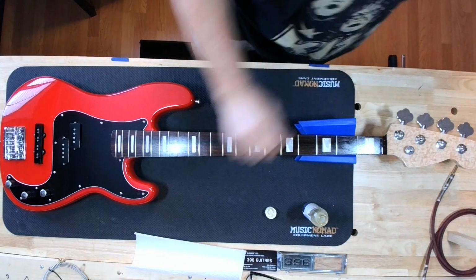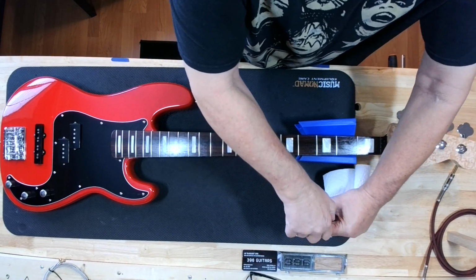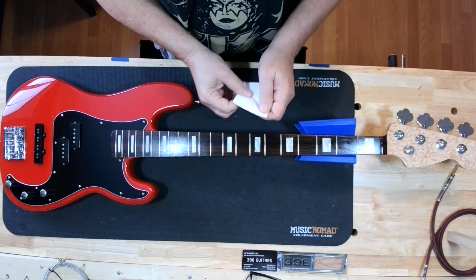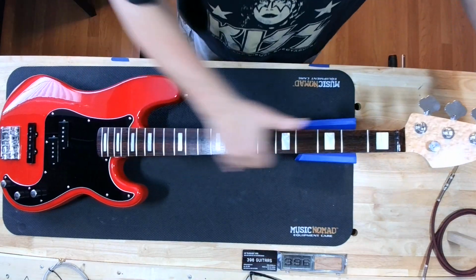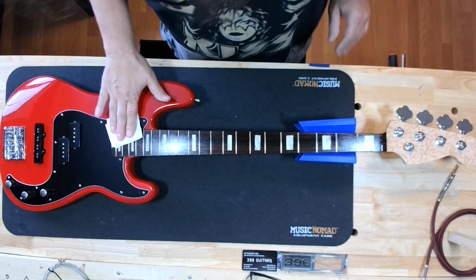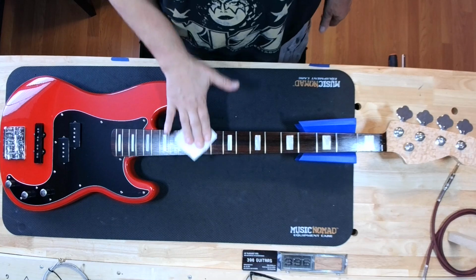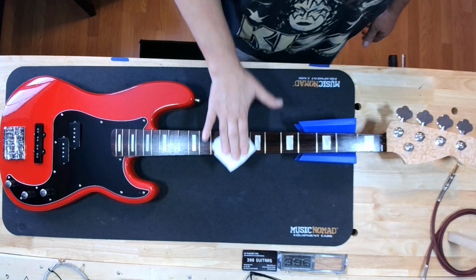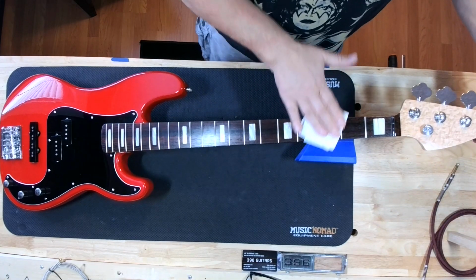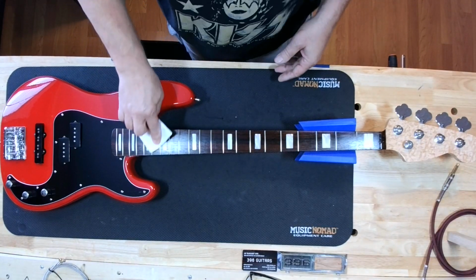And yeah, we'll go from there. So I think that, and of course, that's always a big reveal moment when you oil a dry board. I say it over and over again. I know some of you guys think I'm a parrot. I just keep repeating myself, but some people haven't seen it. One last little pass. You don't want to leave a whole bunch of that on there, but you don't want to take it all off. You want to kind of rub it in so you're not putting a lot of pressure. You're just letting it absorb in. And over the next couple of days, it really absorbs in, but it stays that deep, rich color for quite some time.